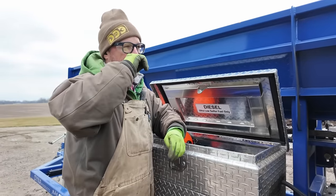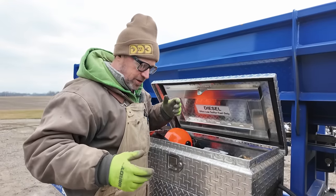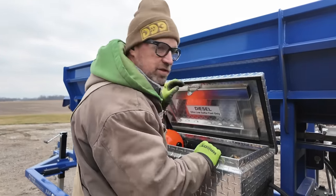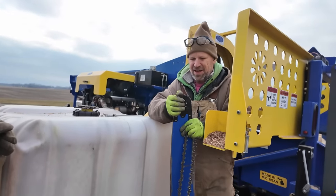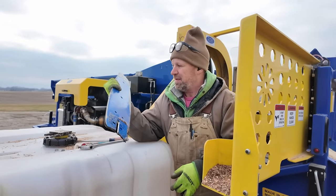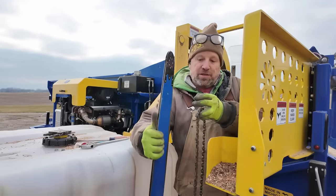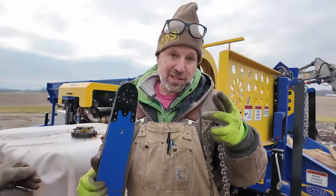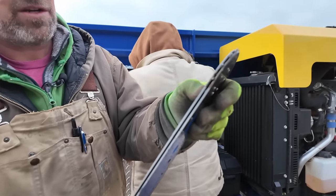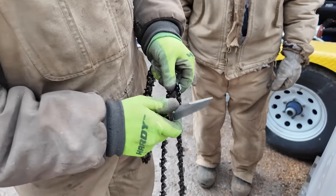The chain is caught on the bar that's stuck — it's either too tight or something's jumped off. I need to find a screwdriver and some tools and go after it. So I got this bar off and this top sprocket is stuck. There are a lot of moving parts on these things, and every firewood operation is going to have situations. This is our first one. Fortunately they gave us a spare bar, so we'll put that on and see how it goes. I don't see a grease hole on it, but that other one is just stuck, so we'll swap it out and be back in action.